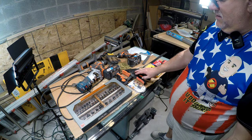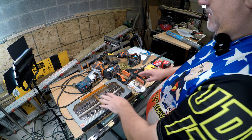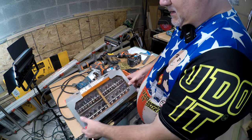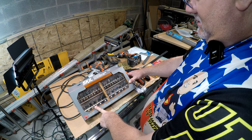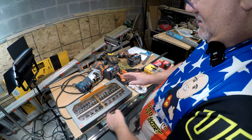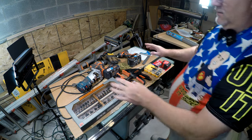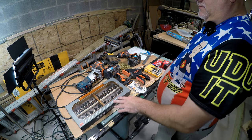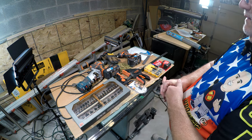You'll want some clamps. So here I have the easy hold. These are the 600-pound clamps, very strong. Optional is a router. So I got my Bosch router here with my Skill bit set. And we're gonna use 2 bits from here. One is gonna be a roundover bit, and the other is going to be the chamfer bit. So we're gonna use the chamfer bit to give a nice chamfer to the boards that are gonna wrap around it. So that way it's easy on the eyes. But the top and the bottom of the boards will be rounded, just so that there's no sharp corners on any of the boards.